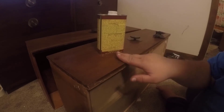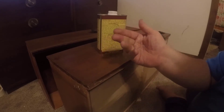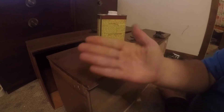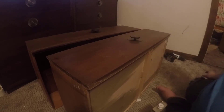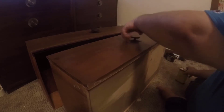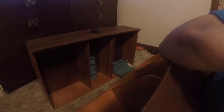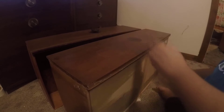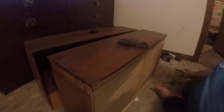Since the directions mentioned using steel wool — good for heat rings and that kind of thing — and this finish feels really really gritty and is in really rough shape, I'm going to use some steel wool on it. But first I want to remove the hardware. Luckily on these ones you can just grab hold of it — there's one screw — and the hardware comes right off. Now you can see how badly faded it is by looking where the hardware came off.